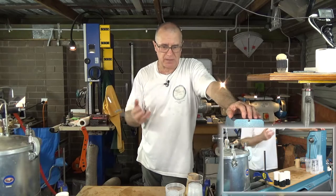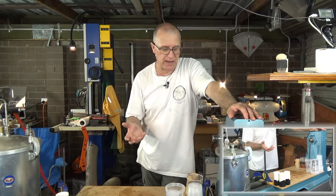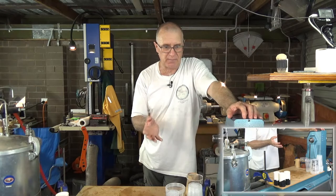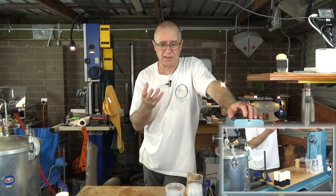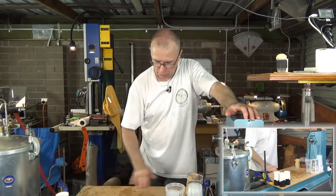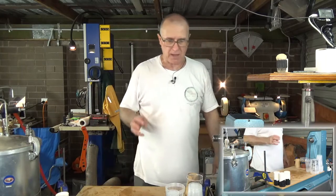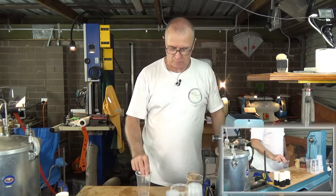The way I've done it, if there's holes on the bottom that don't go all the way through, then the air's going to get trapped in there. And then, of course, once we put it under pressure, the pressure is going to try and force the resin in and force the air out. But as the resin starts to cure, it can also trap bubbles in there. So I think that's maybe what's happened with that one there. I'm not holding a lot of hope in that one at this particular point in time. But if we can get them into a vertical mould, then I think we'll be as good as gold. So right, we'll have another ply.